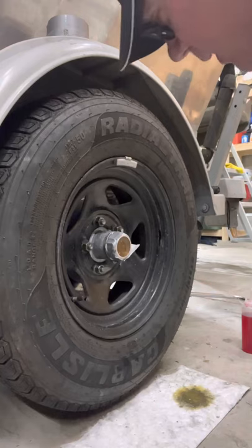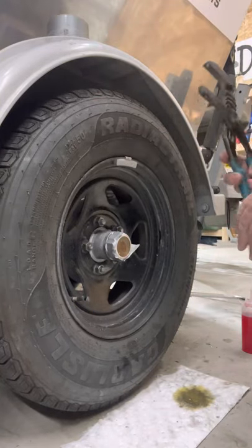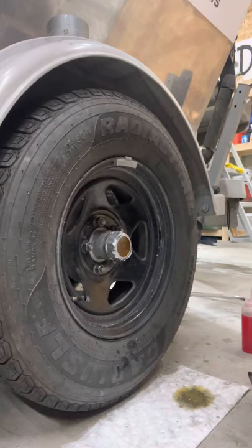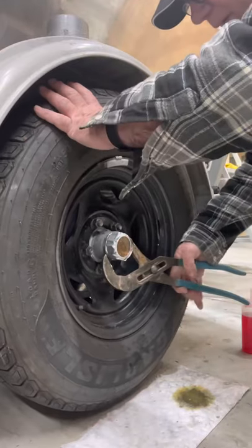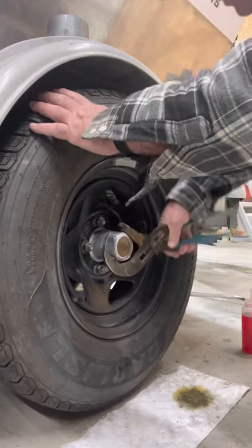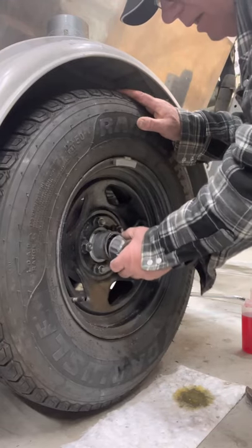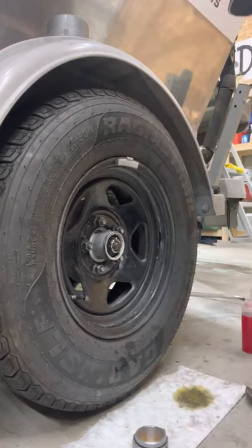For the maintenance on these hubs, Easy Loader does sell a wrench to take these off, but I use a pair of channel lock pliers with a little duct tape over them to avoid marring the hubs. You don't want to use a lot of pressure taking these off — they are aluminum. I've heard horror stories about guys cracking the sight glass doing this.